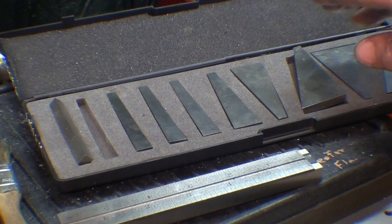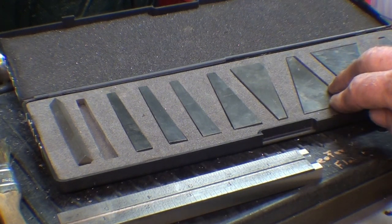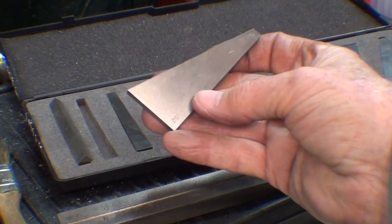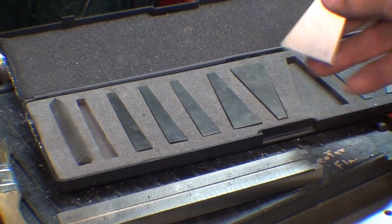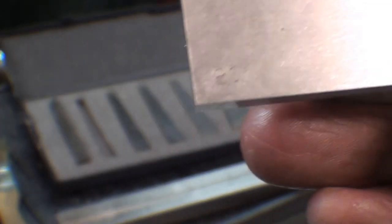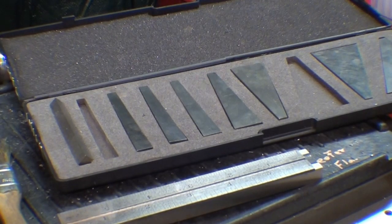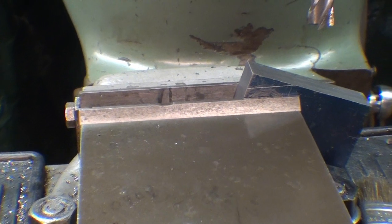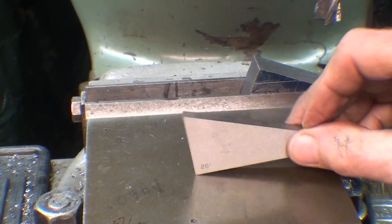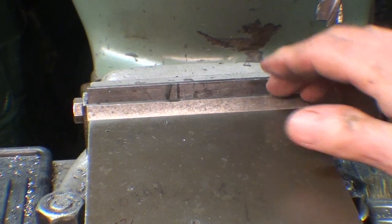Here's the other way. I own a set of these taper gauges, or they're almost like taper parallels, although they are not parallel, but anyway, these are handy, and as luck would have it, is there such a thing as luck? There is a 20 degree one. Does that show up or not? Yeah, 20 degrees. So, using that in the vise, the way we set things on parallels, but again, it's not parallel, so I'll just pop this into the vise, make sure everything's clean,